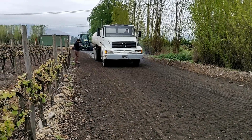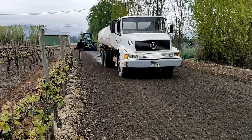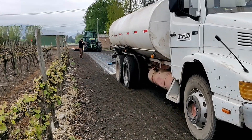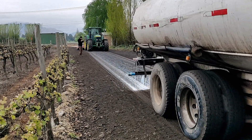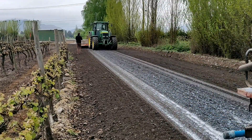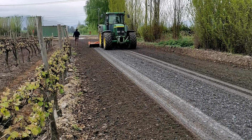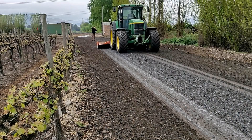Here we're going on the second run, pretty much going over yourself to make sure you didn't miss any spots — hence the one part APS to six parts water, so you have enough in the water truck to do this. You'll notice the APS is not getting sucked into the soil as fast as before because you already have one pass with the water truck. Again, you follow with the tiller.